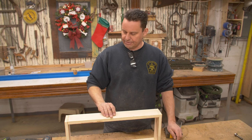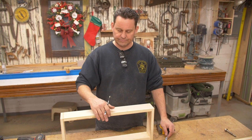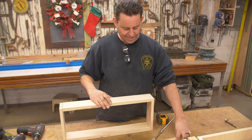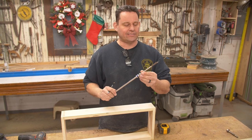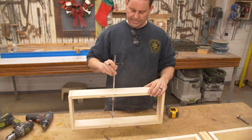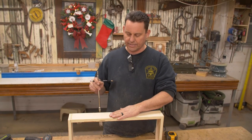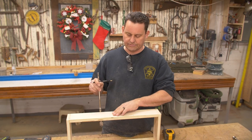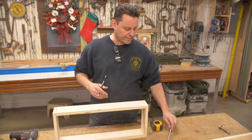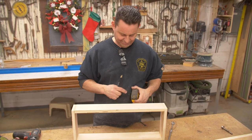So what we're going to do is — we've got our drawer set up and we need to drill for the dowel rod. We've got ourselves a nice little spade bit with an extension. We're going to come through here and into here, but we're only going to go about halfway through this wood, and we'll cut it flush here and the oak will capture it up here. So right now we just need to find our center.